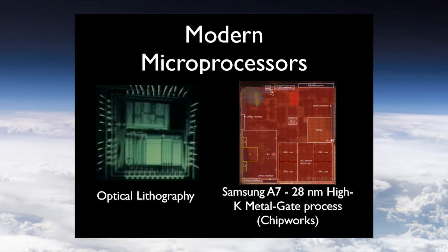Looking at the chip picture Feynman had versus the Samsung A7 chip in many modern smartphones, we're talking about 20,000 times reduction. Transistor sizes ranged from 5 to 500 microns in the 1980s. We've gotten to the point now where most modern cell phones have 28-nanometer transistors — 1,000 times smaller than what was available in the 1980s. Intel's roadmap says we'll be down to 10-nanometer gate sizes by the year 2020, so in about five years we're going to be roughly a third of what we were a couple of years ago.